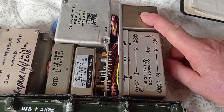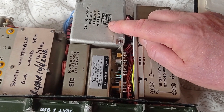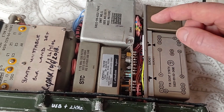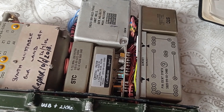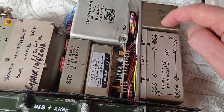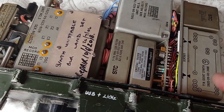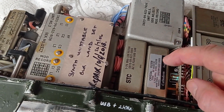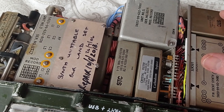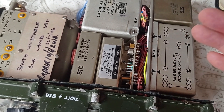What the mod involves is basically getting rid of the reference oscillator. You can still run the mod on 110V but if you want to be thorough, since we've got the radio open, you might want to change that as well — it's up to you. The DDS provides two signals out: an IF output, which is a sine wave that goes into the voltage-controlled oscillator where it gets mixed, and another output that goes into the synth, which is divided down — and that's how it works out the frequency.